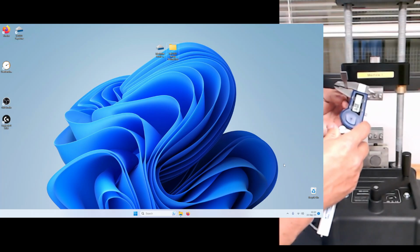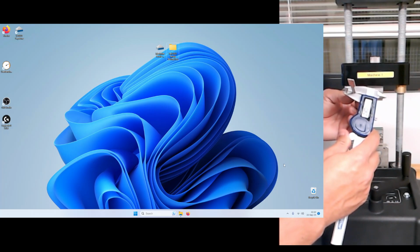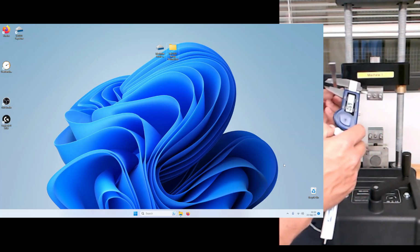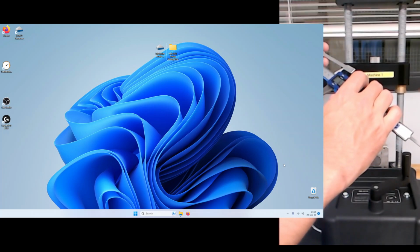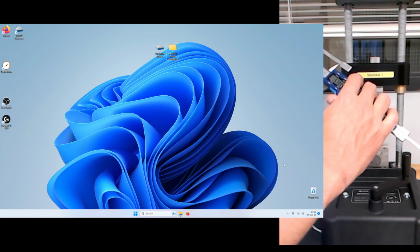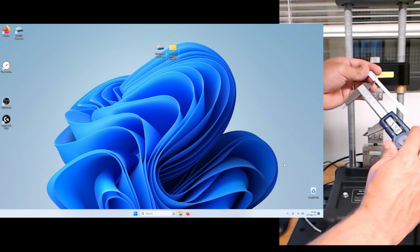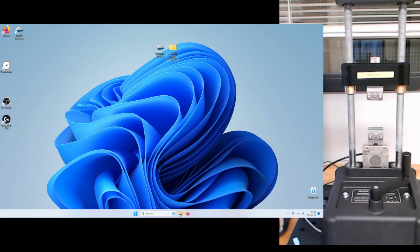And this one is about, well, this is about 0.8 in the thickness dimension. Okay. So we have these measurements, record them. And then also go ahead and measure the approximate testing length or the gauge length. And how do you do that? This doesn't have to be super precise, but you want to get an idea of what the length of the test region is. That's kind of where it just becomes thin on either side. So this one's about 58 millimeters.